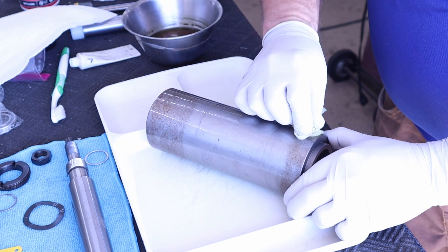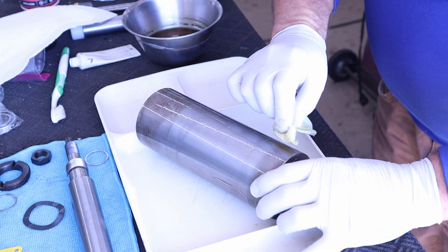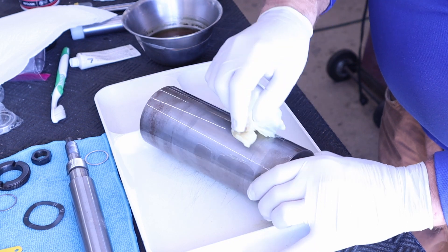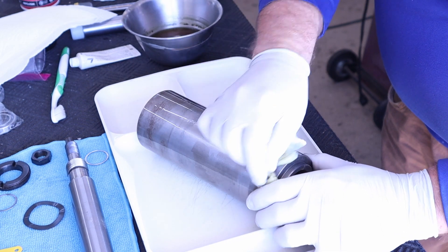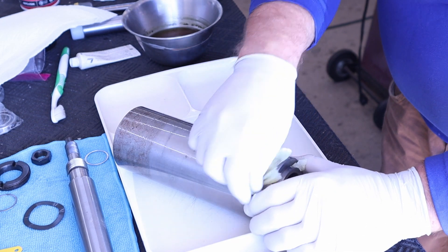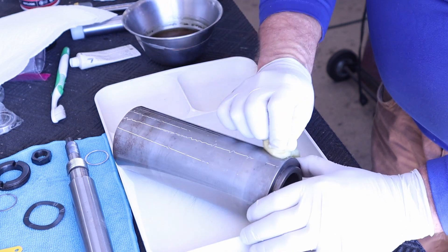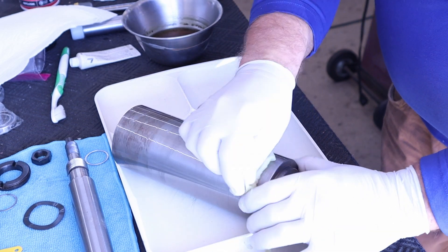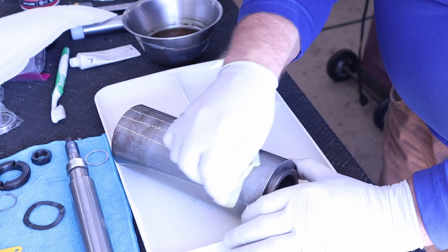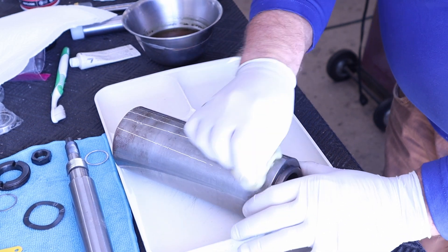The spindle shaft goes through. I'll talk about the insides when we get to that point. It didn't seem too bad, but once I took it apart — I hadn't really run the machine a whole lot since I got it — I knew there was some work to do. The bearing's been running freely. It's a high-speed spindle. I only have the one pulley set for it, which runs it at a moderate speed. I think it's one-to-one, so the typical grinding speed is right at 3,500 RPM. It's done well — I just needed a better finish on my part and I could tell that something was wrong.